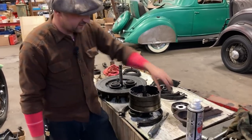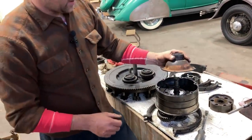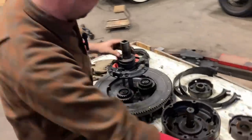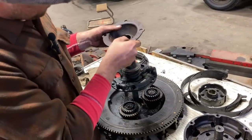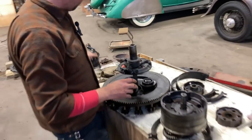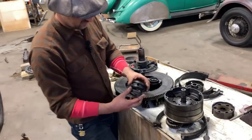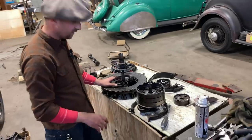That's basically the inner workings. This is the fourth main — it's babbitted, needs to be re-babbitted. This is what supports the back of the hogshead, the transmission. It's a little bit complicated, but not overly. This is the main clutch spring — a big flat wound spring. We got a new one for it, but we just needed to harvest some parts out of this engine. We needed some gears.